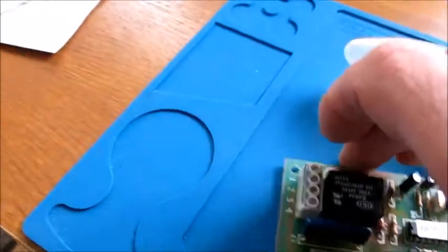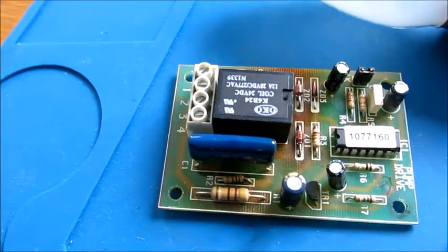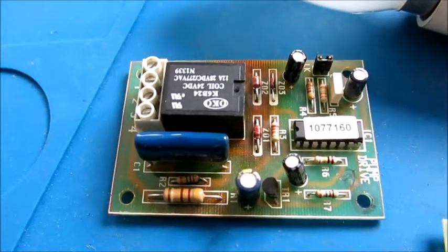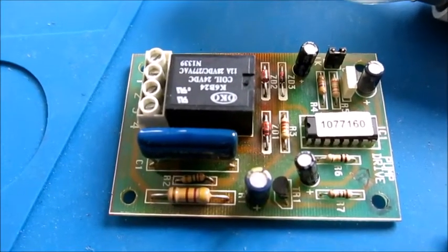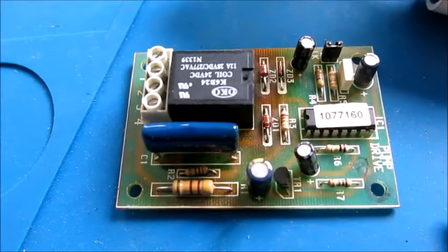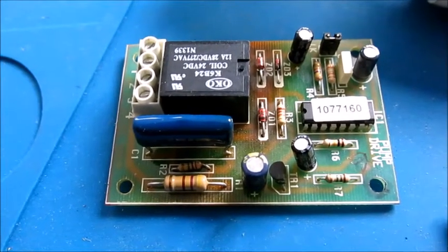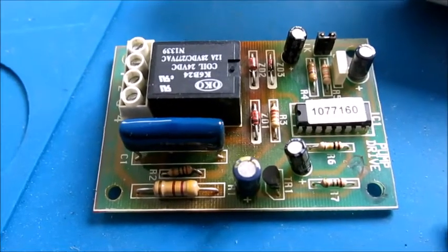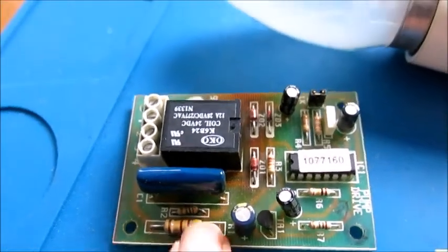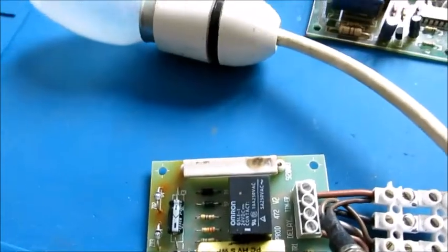Now, one of the problems with this is that it can start buzzing. There is the other card, which is this one. This is the pump drive PCB. This has a slightly different job. What this is designed to do is periodically, when the central heating is not being run very much, typically in summer, run the central heating pump, just to exercise the system and stop it getting stuck. Quite often through the summer, when they're not being used, pumps will stick, and then when you come to turn the heating on in the winter for the first time, they just don't work. And you hear people hit them, tap them with a hammer and things like that. But this helps to avoid that happening. So I'll come back to this board in a second or two and explain why that one can be buzzing sometimes as well. So with this one, I've rigged up a little test rig here.